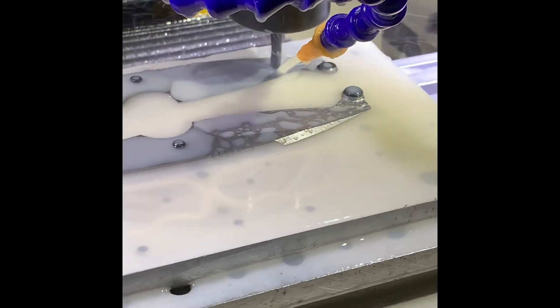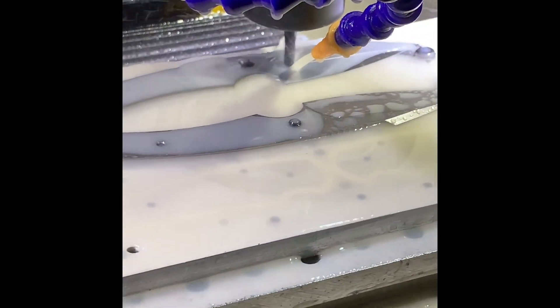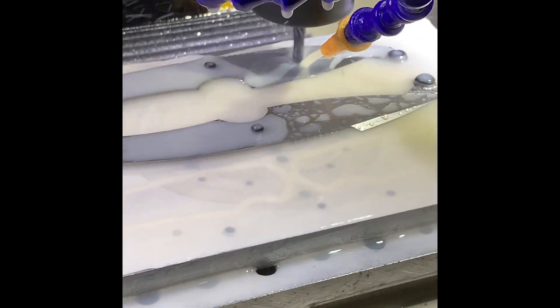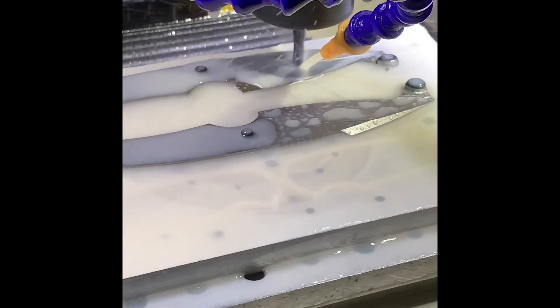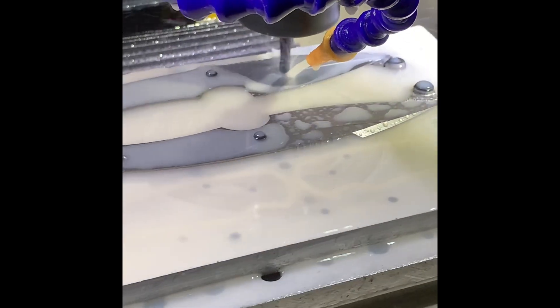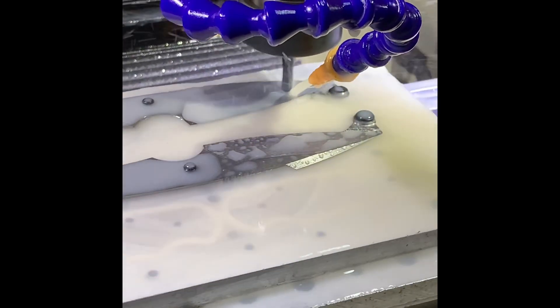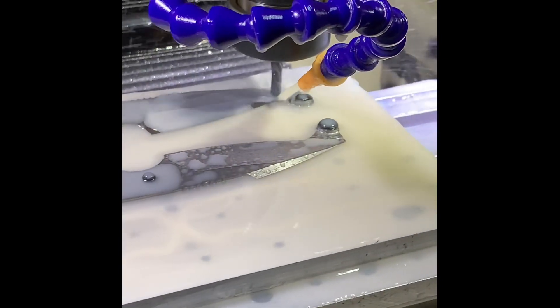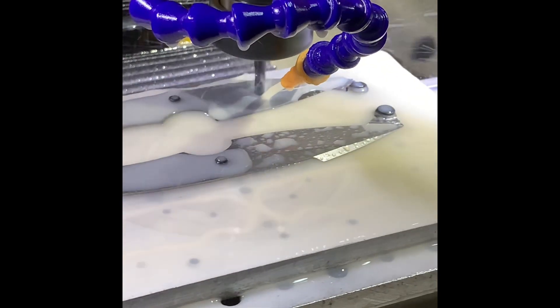The final operation for the bevel — this is the finishing process using a 6mm 2-flute end mill, running pretty fast, taking 0.05mm step-over cuts. The operation is fast but comes out with a really nice clean finish, which gives me a great surface to work with when I do my hand finishing.